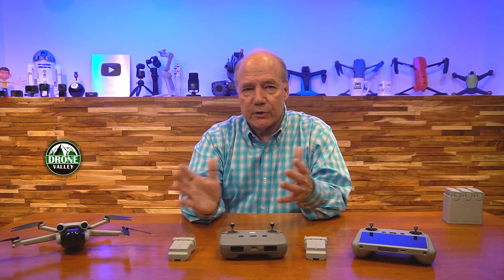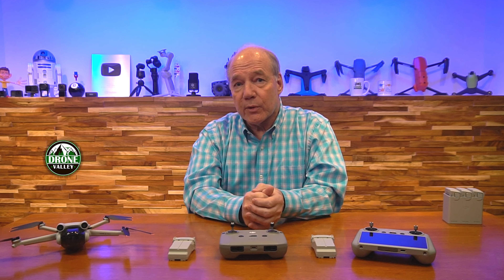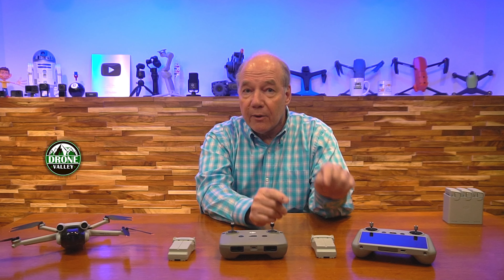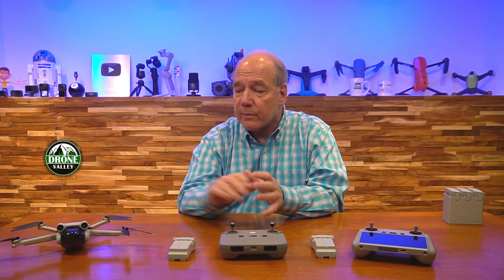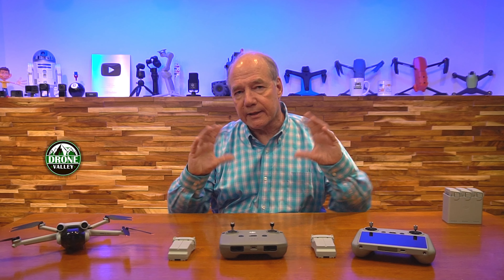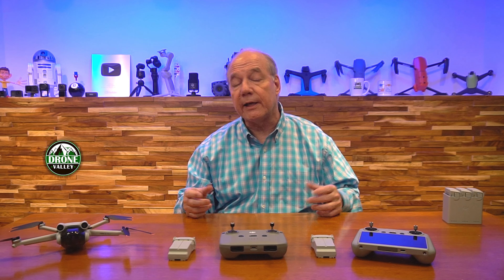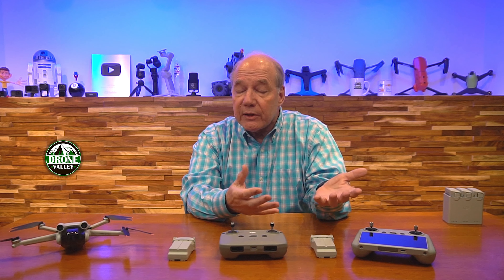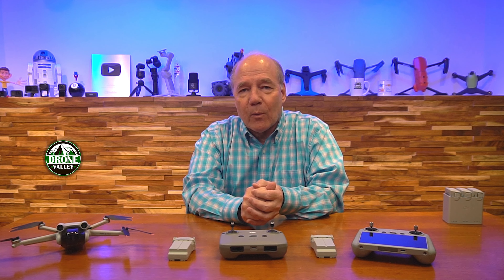Another key consideration is wear and tear on the drone. A lot of people wonder if the heavier battery puts more strain on it. The honest truth is DJI designed this drone specifically for the larger battery and came out with the smaller battery to offer it under 249 grams. All the electronics inside — including the flight controller, the ESCs that spin the motors, and the intelligence that compensates for wind — were all designed for the larger battery. So using a lighter battery actually means the drone is working less hard, not more.